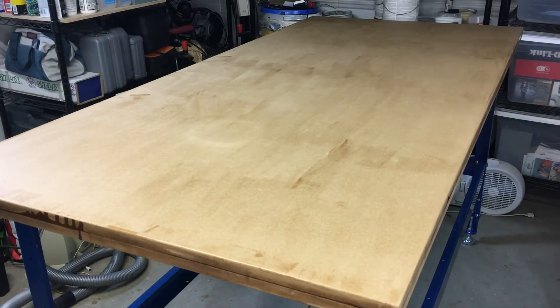Other options would be to paint this, or I could put epoxy on it first, sand it down, and then put some finish on — if I did that, the finish wouldn't soak in at all, it would just lay on top of the epoxy. One thing to consider is that epoxy can deteriorate with UV light, so if you have it near a window that can ruin the finish. I'm going to put another coat or two on here.